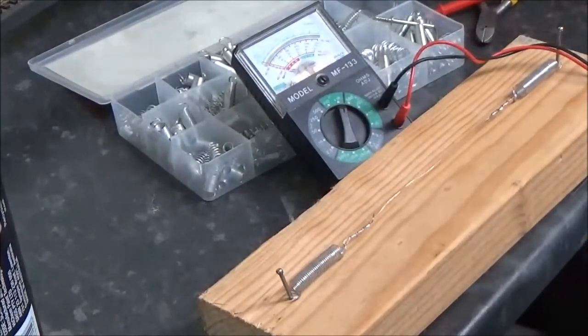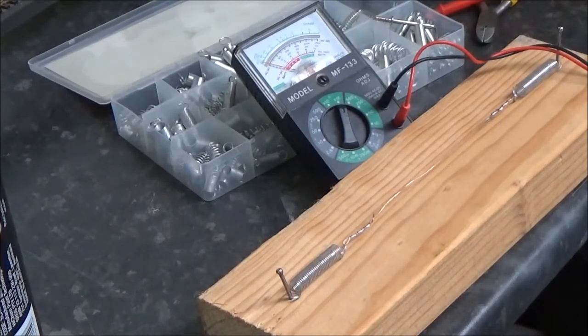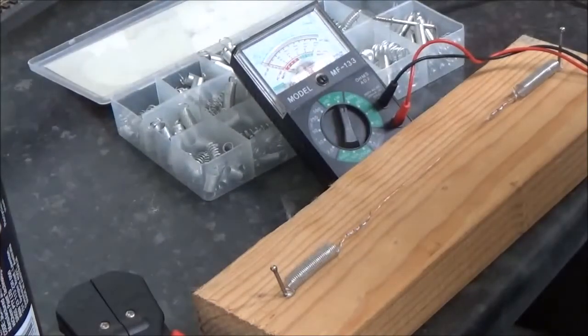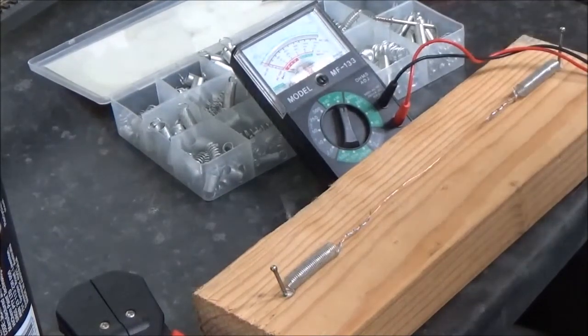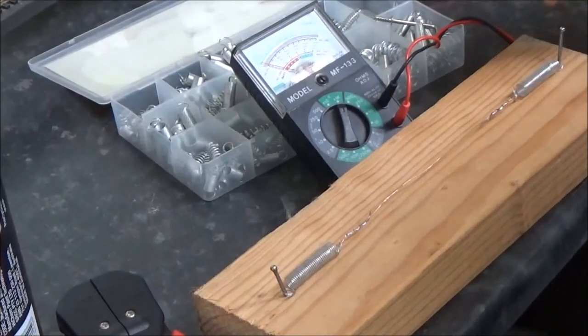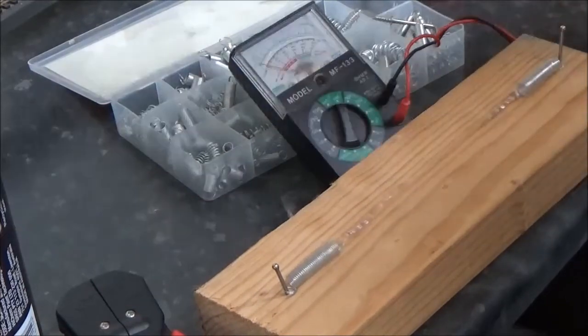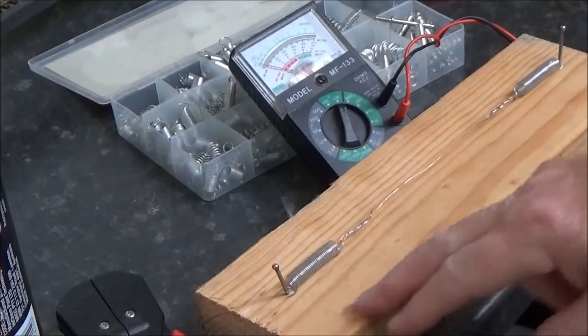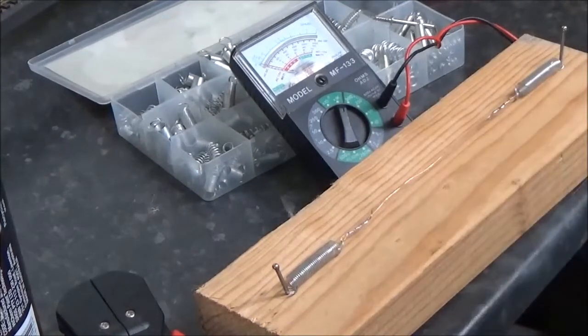Being a bus, you can solder a wire anywhere along the length of that. I know that's a short length, and you might say that's a bit of a waste of time — but under a baseboard, this sort of thing could be quite a lot longer. What you can do with this: if you need to make a longer one, you just slip that off and start again. If you need to turn a corner, you can go that way, or slip another spring over the top and pull it down that way. You can have a parallel one running for the positive and negative. It's that easy.